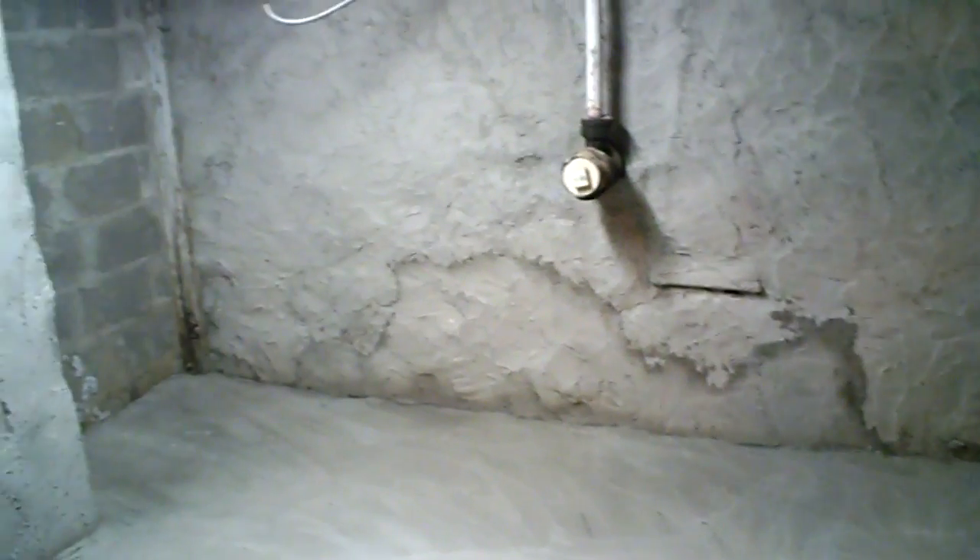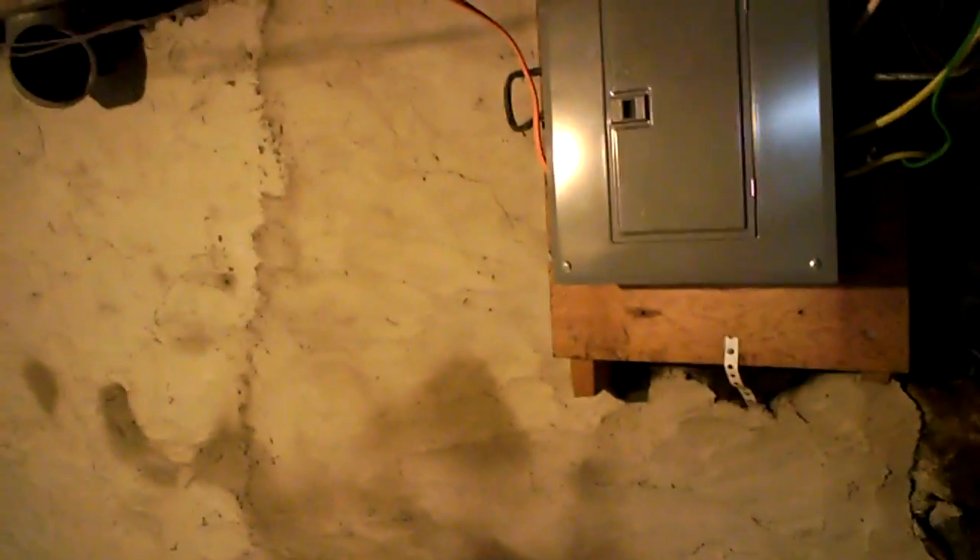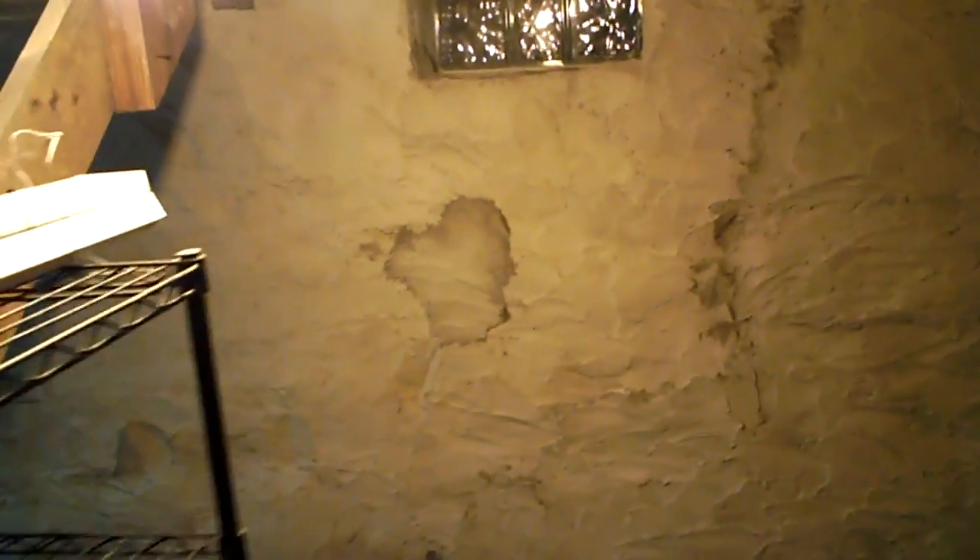All right, I got it done. You can see I've used cement on all the walls that had exposed rock, all the way over to the fuse box. I used Type N mortar, which you mix with three parts sand — that's what I smeared up on the walls.